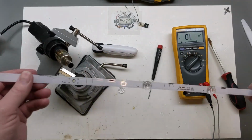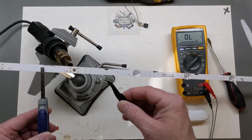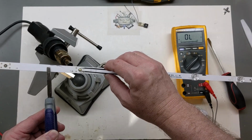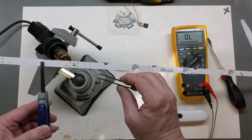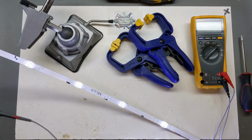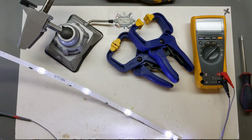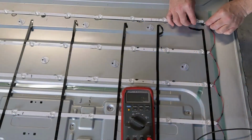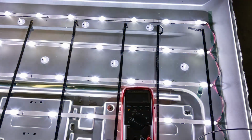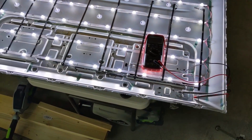So I think that's long enough on this video about the troubleshooting of the Sharp 58 inch. In the next video, we'll look at the repair of the LED strips. And you can decide if you'd rather repair them or just buy them from somewhere like Shop Jimmy or eBay and replace the strips. But on this TV, I'm going to decide to just replace the SMD LED chips since it's only two of them bad and the TV is only about 2 years old. So if you're interested in that, just go on to the next video where we show a little bit of bench testing and then the replacement of the surface mount LED chips.